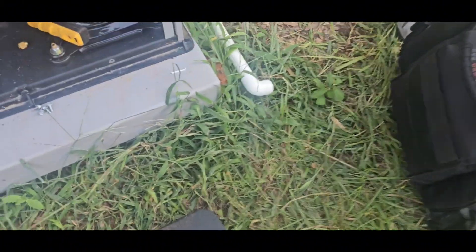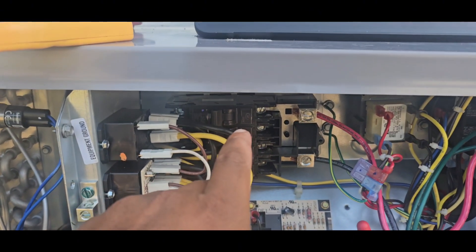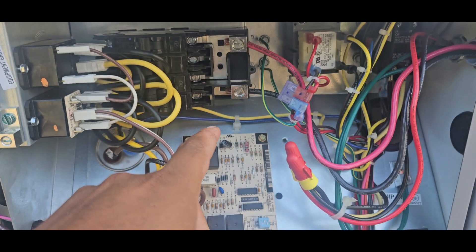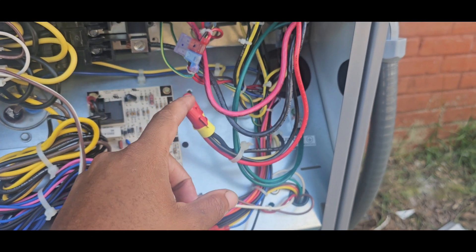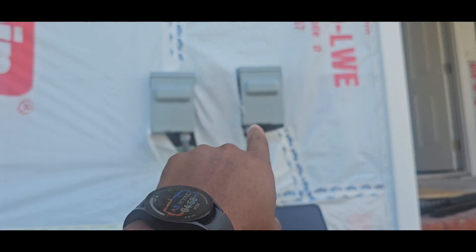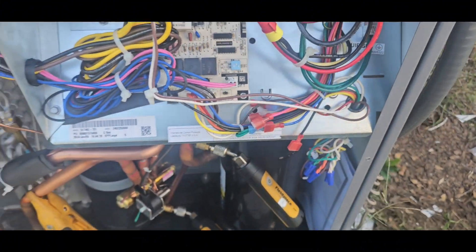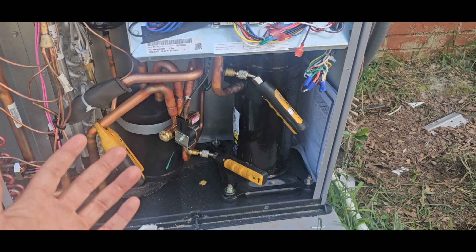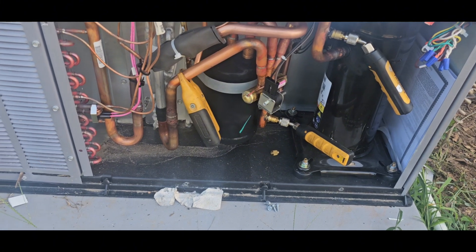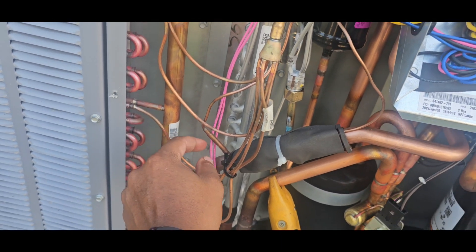Before I dive into MeasureQuick — more audio was lost on the original footage from Saturday. I had to remove some wires from the back end of that disconnect switch to end up wiring the high-voltage specifically for its own circuit. We've got two different disconnects here — one for the main power of the unit and the other for the heat strips. Whenever I start up any of these Tempstar package units, I immediately look for rub-outs and anything that could cause a low-voltage short, especially the way they run some of the defrost wires.